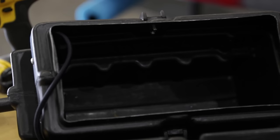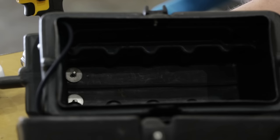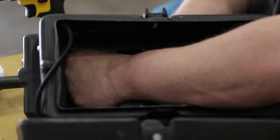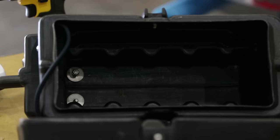Now I'm going to come in. I always like to put some extra washers in here. That way if I do bump this on the bottom of a lake or river, hit a little stump or something, I'm not going to tear my transducer out through the bottom of this. The washers just give me a larger platform for it to rest against. The other thing I'm doing is using the nylon lock nuts — that way I don't have to worry about these backing out.